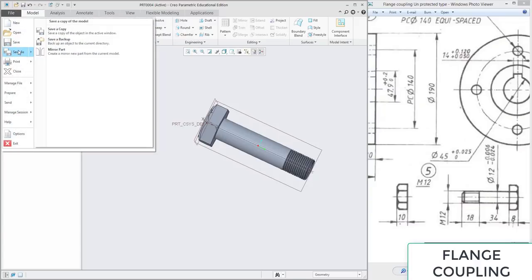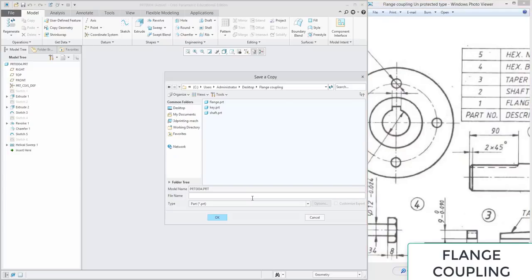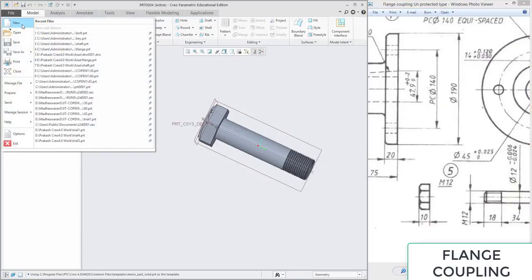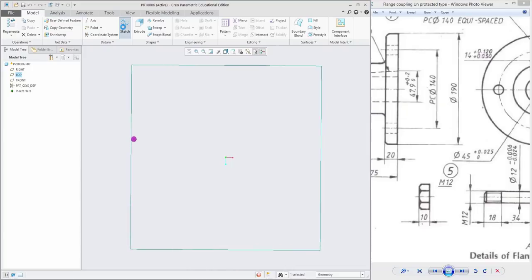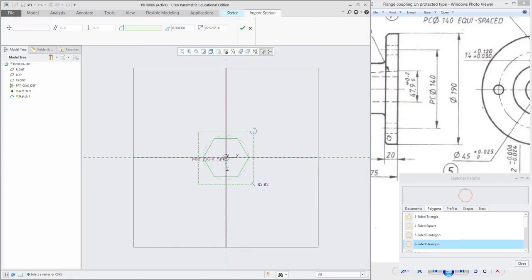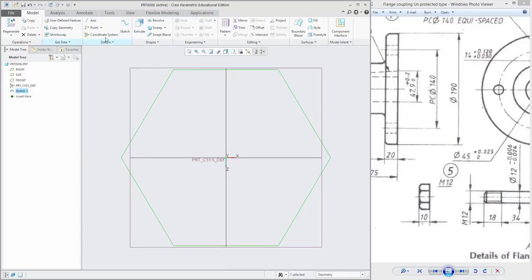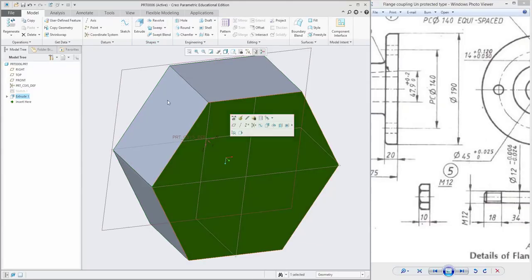I have made the cut in this bolt head. Just do it by yourself. Yeah, this one is bolt. Now wait, last one is nut. This is the shape of the nut M12. Drawing this, and also I'm choosing this palette and put the value 12 here. And next to this, that length is, sorry, height is 10 mm.